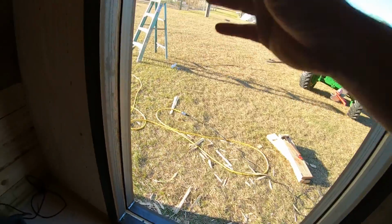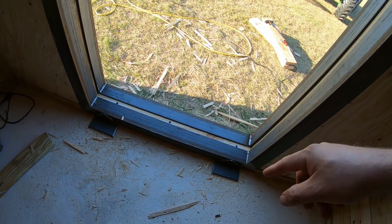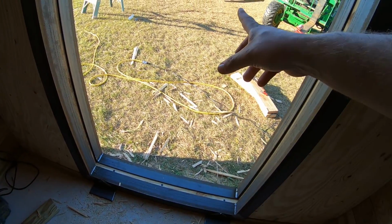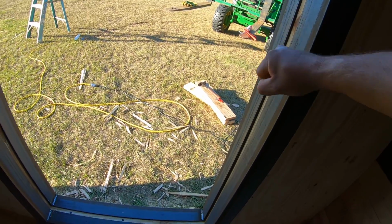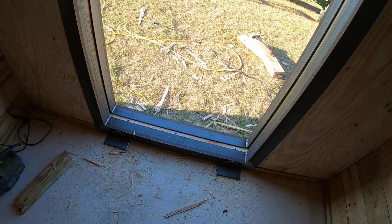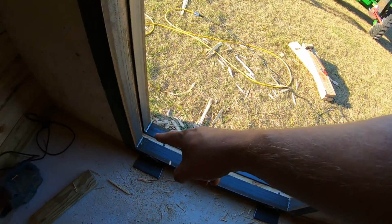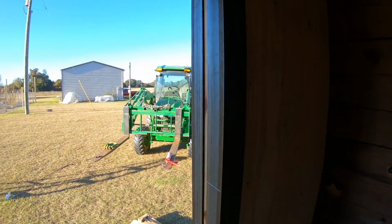So once I weld and tie this whole door frame together and then lag bolt it down into the concrete, I mean, you can see how if something were to suck the door that way, which would be also latched into the steel, or something were to hit this way, it's not going nowhere. I mean, it's just absolutely not going nowhere. And don't forget, I've got Tapcon screws all down to the concrete all through this wall too. So this wall is definitely not shifting.